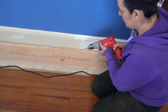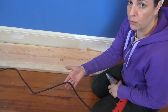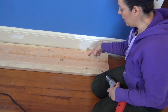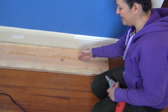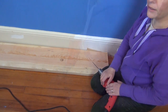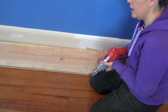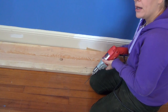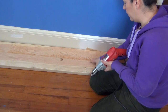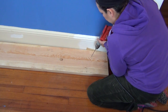And I'm doing this at a slight angle. I'm going to have to move the wire here instead. But I'm going to do it at a slight angle, not 45 degrees, but slightly this way, going this way. All right? Let me change my position and then I'll show you what it looks like. And the reason why I want to put a screw on an angle here is that when I put the uprights and I'm screwing the uprights into this part here and into the wall, I don't want this particular plate here to move, all right? We just get going, simple, light angle.